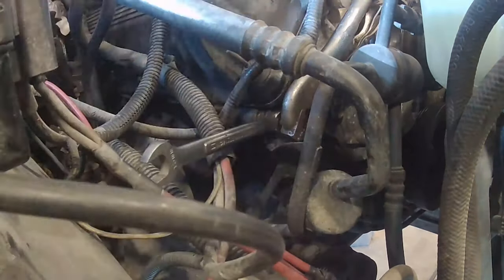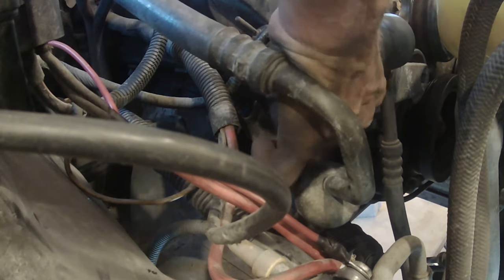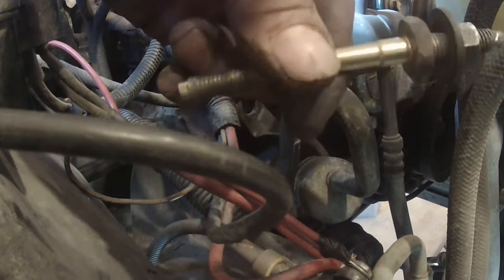If you run into the same trouble: there is one nice salvation — you don't have to take this nut the whole way off, because it's not a hole drilled, it's a U-shape at the end made to slide the AC lines over. You only have to loosen the nut. The compressor sits real nice on the front sway bar and that gives enough clearance. I'll turn the whole stud setup out with the nut on the end, and before it goes back I'll get that nut off so it works right.